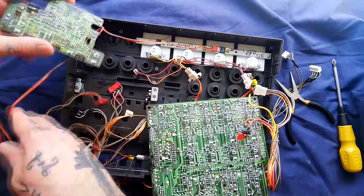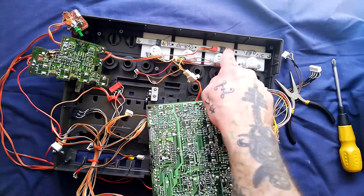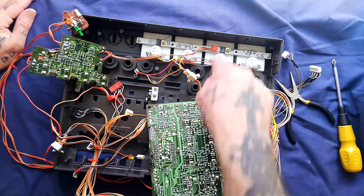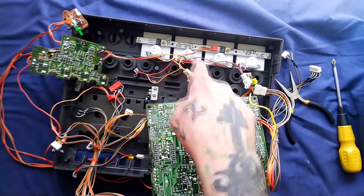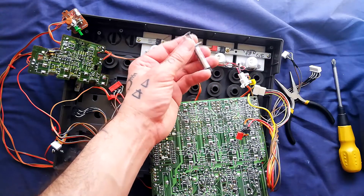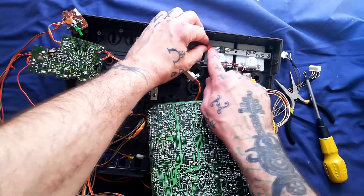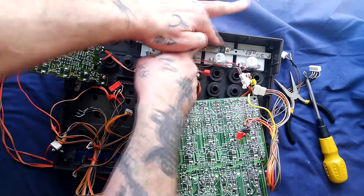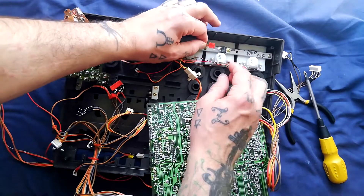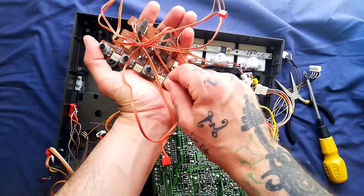That leaves us with just this brown, red and orange ribbon cable with a red connector that goes over to the rightmost of these two voltage regulators, which are attached to this metal plate at the back of the meters — that metal plate acts as a heatsink. We want to remove the cables rather than unscrew the voltage regulators because the voltage regulators will be held against that metal plate with some sort of heat compound, like the kind you'd put on a CPU heatsink. So when you remove this ribbon cable, be aware that the brown cable should be on the leftmost of these three pins. It's possible to flip it 180 degrees and your system won't power on properly. At that point the Q amp PCB is completely separate.